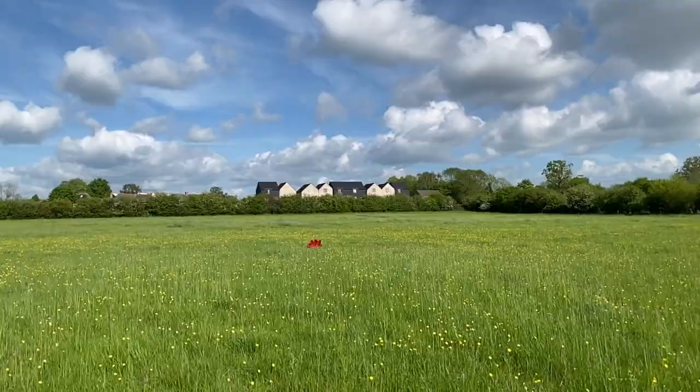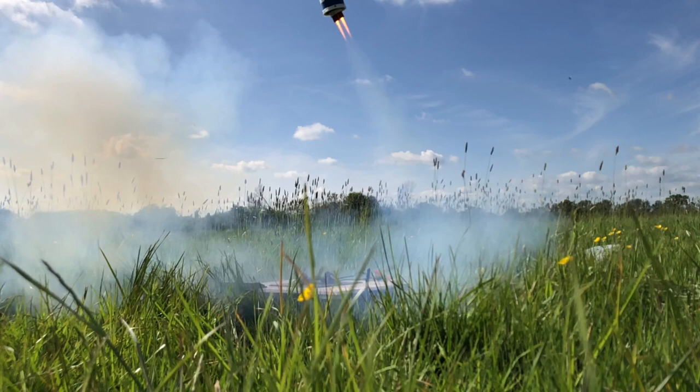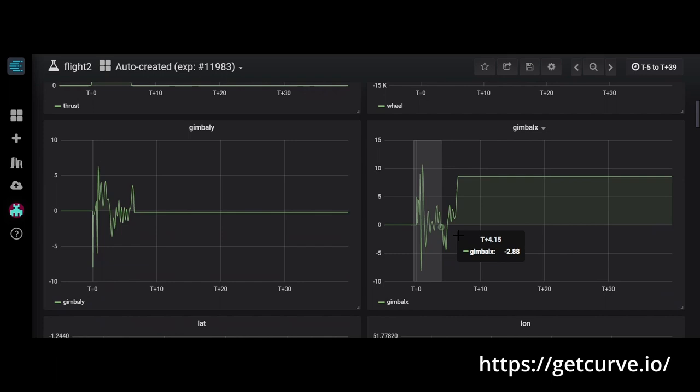You may have noticed that at the beginning of the flight, just after liftoff, the rocket violently pitches over before correcting itself after reaching about 10 degrees. To understand why this happened, I'll show you some of the data gathered by my flight computer. You are now looking at the commanded TVC angles, which control where the thrust is pointing. There is a huge spike in the TVC angle commanded by the flight computer, which is what kicks the rocket in the wrong direction.